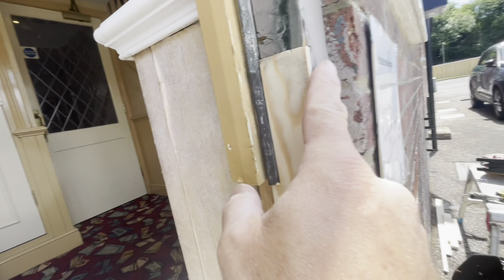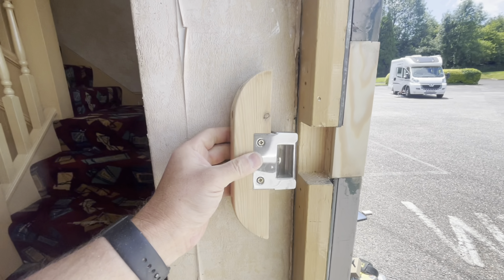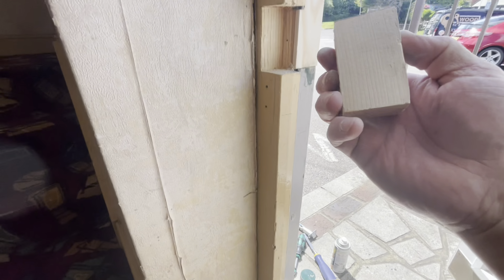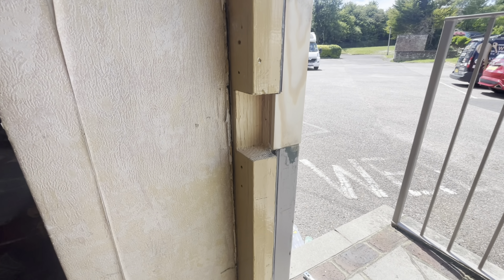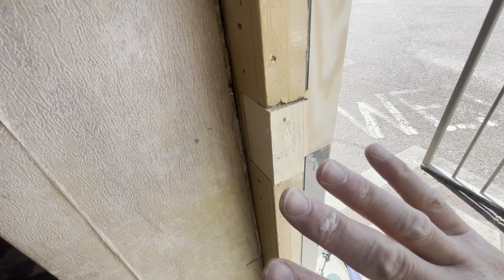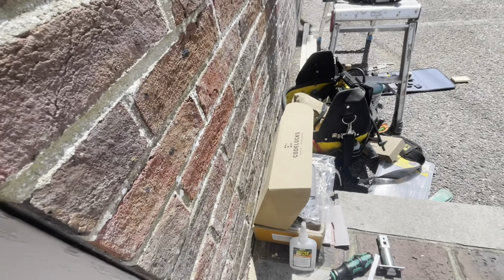I'll probably cut a plug in here first, get it all made good, and then do the hole for the latch. There was a big old keep — taking that off, starting to make that good. The keep for the actual night latch was affixed in this block, so I'm going to whip that off, make good all of this block, cut a new block for it, get it glued and screwed in. I've done a first coat of filler so I'll give that a sand and then start fitting the lock — the block is now screwed and glued in. I'll get the plane on that, get the filler on, get it all sanded, and then we can start putting the code lock in.